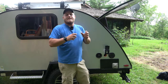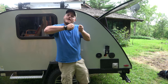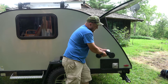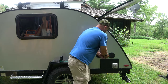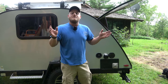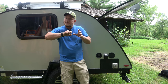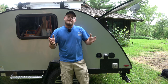Firmly attach your conductors — make sure the screws are backed up, your wires are stripped to the right length, push them in, and twist down on them. Give each one a tug and test it out. Once the strain relief goes down, you can compress this into the outlet cover. It should make a nice connection before we return this to the wall, because once we do, it's going to be a nice tight squeeze in there. Return the screws and we're done. This comes with a gasket that provides a watertight seal. I can open it up to maintain from time to time to make sure those screws are still tight, but this is designed to last a lifetime and make a safe connection.